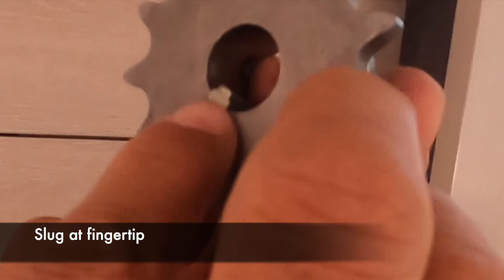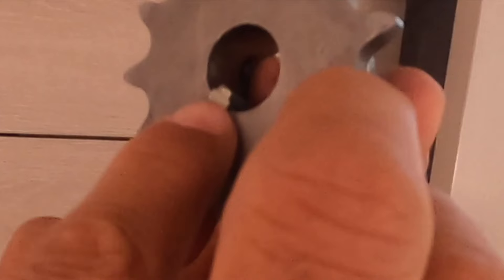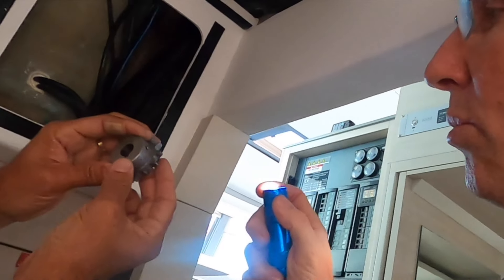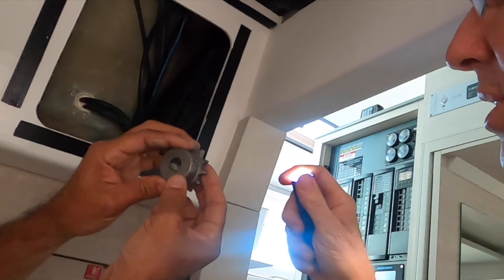So what we have here is a loose cable on the drive of the gear — the gear just came off. That's right, autopilot drive basically. And gee, did it cause us some trouble trying to find where this thing was. We were really lucky to find the three small parts — the slug, the nut and bolt, and the washer — specifically to hold this sprocket in place. Without any one of these pieces the repair job would not have worked.